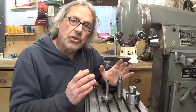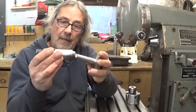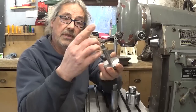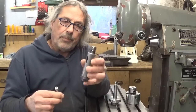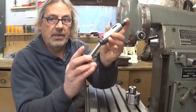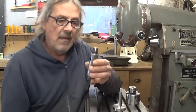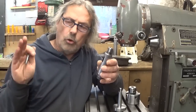A little change of plans - if I cut off the tang on this part it will still fit in the taper no problem, and I can cut a metric M8 thread in here and bolt a bolt in there. That's part 1 of the plan. Part 2: make a new adapter and the bolt that goes in a little deeper will hold this part in place. I checked this special thread - I'll keep the original because it's a really special thread. If I make a new cutting tool I think I can cut it since it has a pitch of 2mm, which my lathe can do.